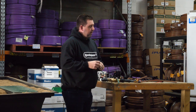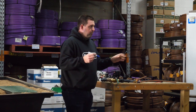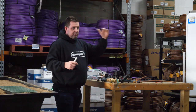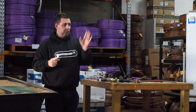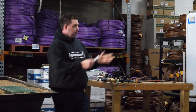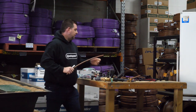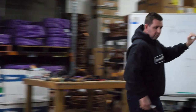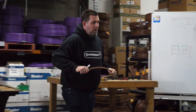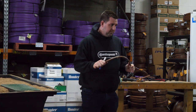At 0.4 by 0.4 we get close to about 12 millimetres per hour. That's good information you can take to your client and go 'we know we're delivering 12 millimetres per hour on the garden and 11 on the lawns - that's why you've got 50 minutes on Monday, Thursday, and Saturday on your lawn, and 45 minutes on your garden.' We don't want to waste your water. The drip tube being 13 mil means we can install it using standard Antelco fittings. When drip tube took hold in Australia, I'm going to say around 2004, this Antelco takeoff adapter became standard.